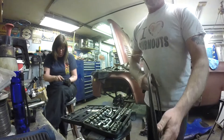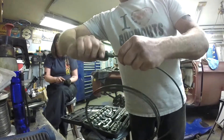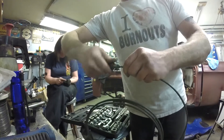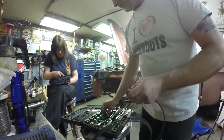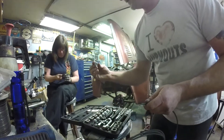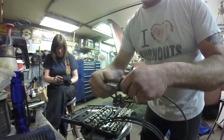All right, you've got your line with a fresh cut on it. Take your reamer and just push and twist, push and twist. It makes a nice decent hole. Now you check that hole with your flaring die — and this goes for the other kits as well. It fits in good and solid. We're happy.